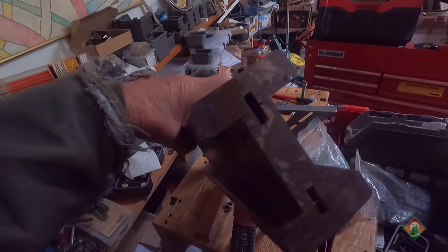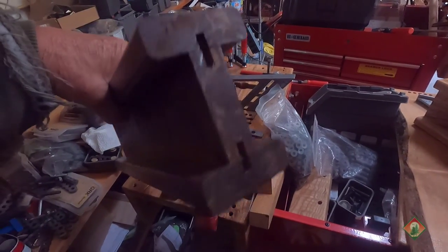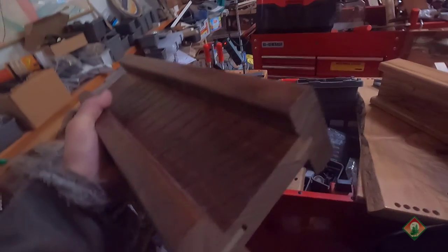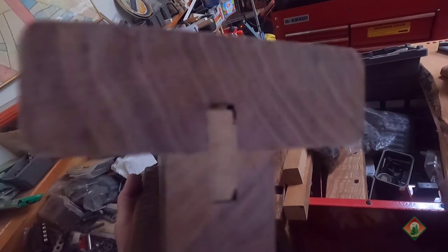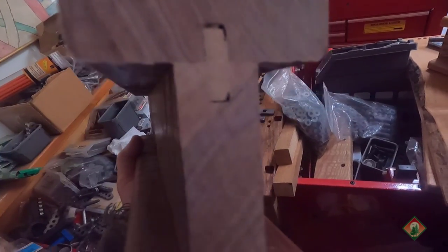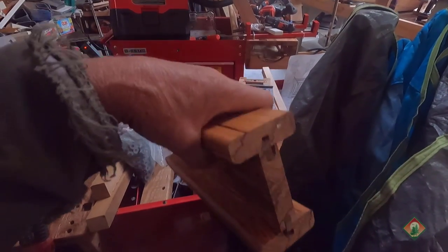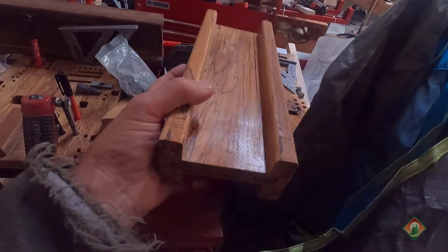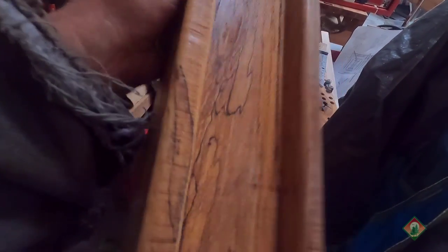To show how prototyping works: a while back I was using a quarter-inch dado blade on the table saw, possibly a shaper too. These are earlier versions of the same concept — probably five to eight years old — and I wanted to test rustic black walnut. The three-inch dimension was already my style at the time. I put quarter-inch dados in each piece and then put a spline in — spline joinery. I was experimenting because a customer wanted a railing to match their spalted oak flooring and cabinets, and I couldn't get solid wood to match, so I had to make my own.